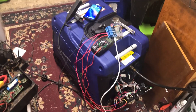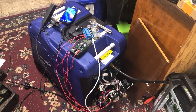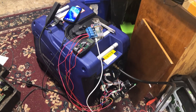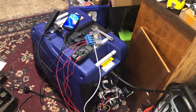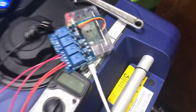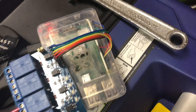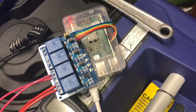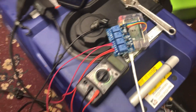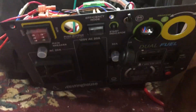I've been wanting to get a generator set up that will allow me to start it remotely from pretty much anywhere in the world. So I have been in the process of hacking this generator to add a Raspberry Pi — that little computer in that little plastic case — and that Raspberry Pi is connected to this relay board, which is going to act the same way as the switches on the front of this switchboard on the front of the generator.